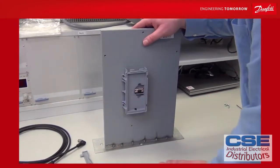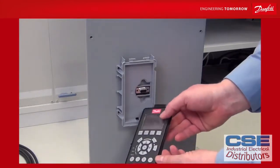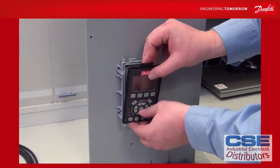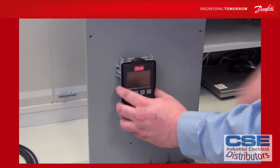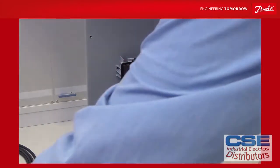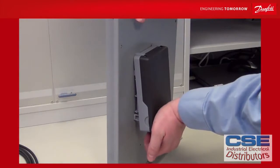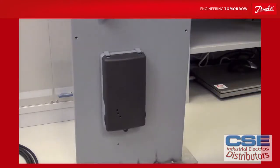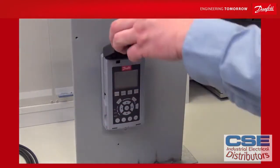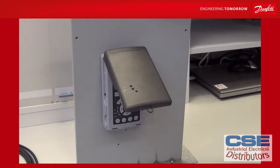Next, take your LCP from the drive and mount it into the cradle. Here we have our LCP taken out of the drive with the gasket around it. Mount this into the cradle and make sure that the top is fastened behind the small holder in the cradle. Then take the lid, mount it at the top and press it downwards until you hear two clicking sounds. The lid can be left fully open for programming, or set like a little roof to provide shade for the LCP and keep it out of direct sunlight.